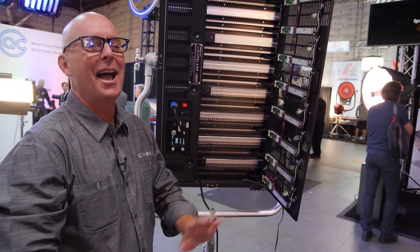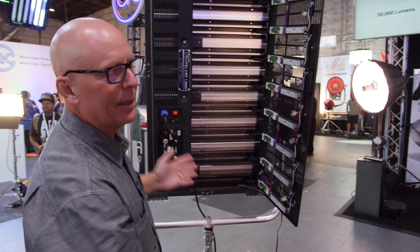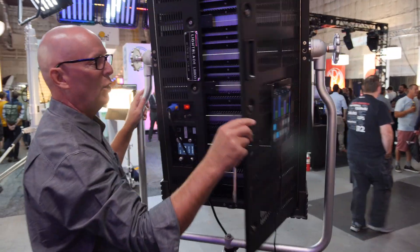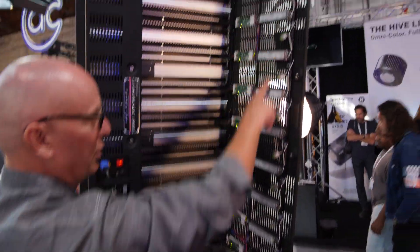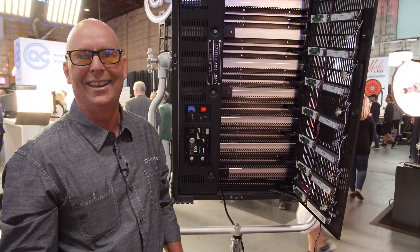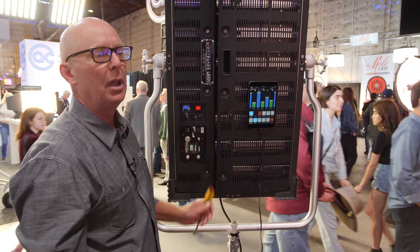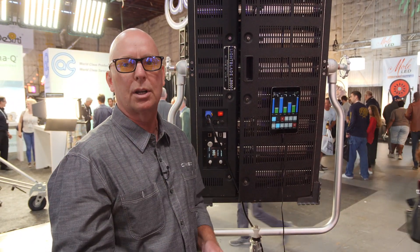This is my favorite part — knowing that people are going to break lights, and there's always L&D to deal with. Rather than making a light you have to disassemble to repair, our light is completely modular. It has a piano hinge — the doors lock open both top and bottom, revealing the 10 zones with their DMX controllers and individual power supplies. If a board or unit gets damaged, it's a simple component swap. All captive screws, easy to open and close. This light was designed for service — the idea is that these have a long life and are really easy to work on on set. Thanks for watching, Luke — always great to have you come by.